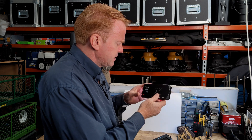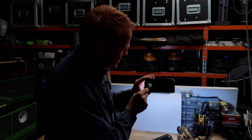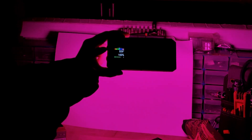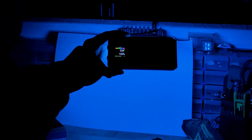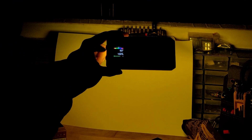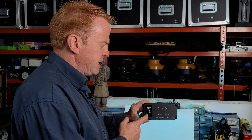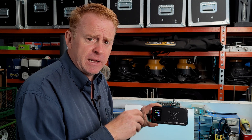Let's get into the next mode of operation. Click the slider across and that is our color mode. In the color mode, we have all 360 color hues. Small increments on the roller adjust in one-degree increments; rolling faster scrolls quicker; quick flicks jump to primary and secondary colors. The bottom roller controls brightness. Operating it manually, you can't desaturate the colors, so it's not the best HSI or HSL mode available.